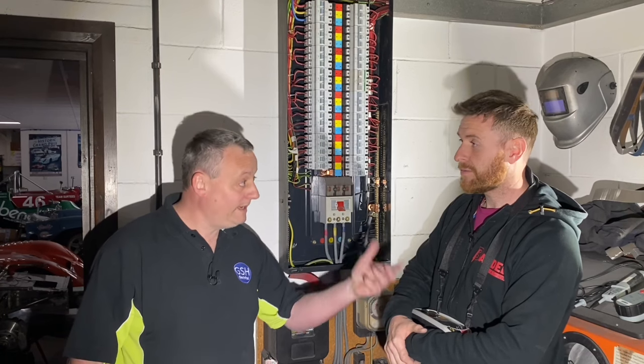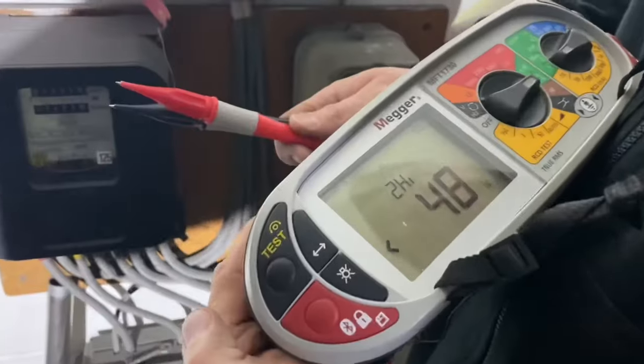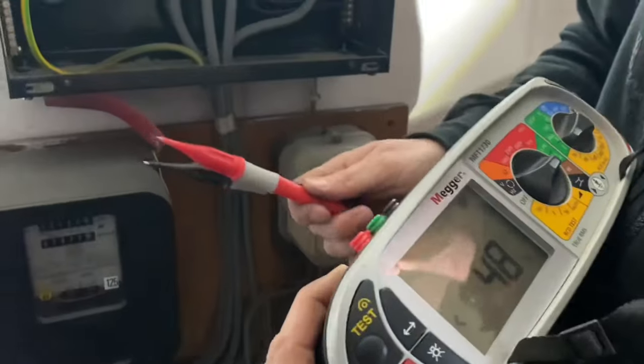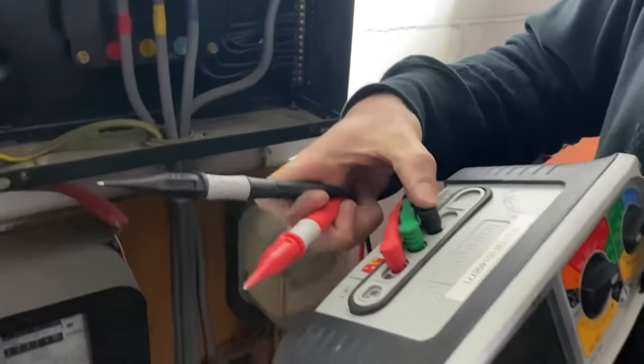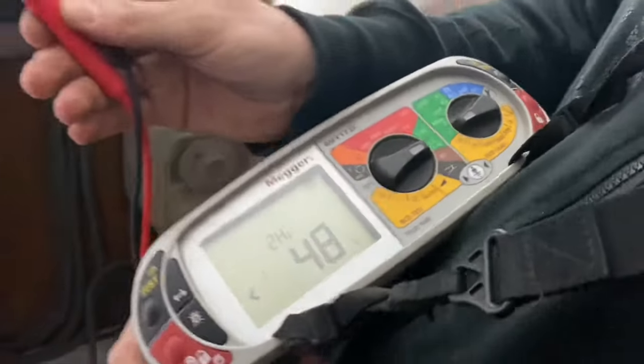This is critical for AM2, AM2S, and AM2E — doubling that reading is an easy mark to lose. Also worth noting: circuit breakers are often rated at 6 kA or 10 kA, and this prospective fault current figure directly affects the type of circuit breaker required. As the qualification develops, test instruments may allow you to directly measure between line conductors. We'll continue and demonstrate that measurement.